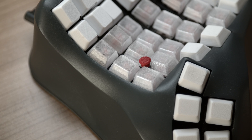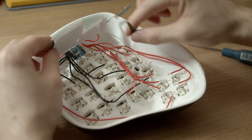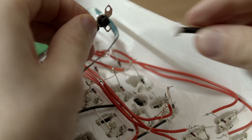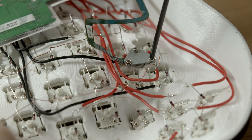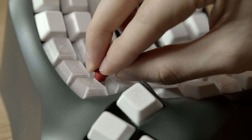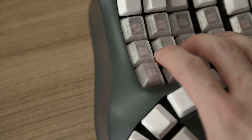I also wanted to get rid of the mouse movement keys that I was using on my Ergodox EZ. For that I added a trackpoint just next to the index finger on the right half. It's not a perfect solution — I just used the trackpoint from a broken ThinkPad USB keyboard and placed its entire PCB in the right half, then drilled a hole at the mounting position for an extension stem that allows the trackpoint to be at the same height as the mechanical switches. It is screwed into the case with the original screws and mounting plate, and on the other side I placed the original trackpoint rubber cap. It works flawlessly and feels just like it should, with the only drawback being that it uses a separate USB cable. For the trackpoint to fit, I printed a keycap with a cutout so the slight movement on it will not interfere with normal typing.